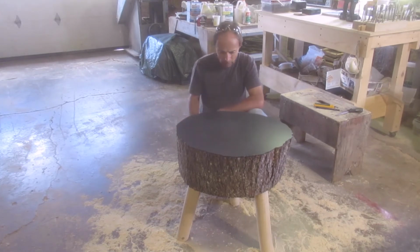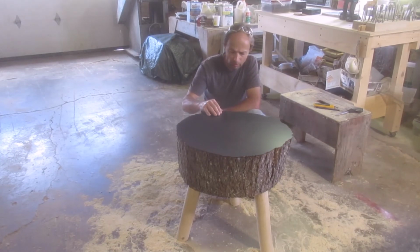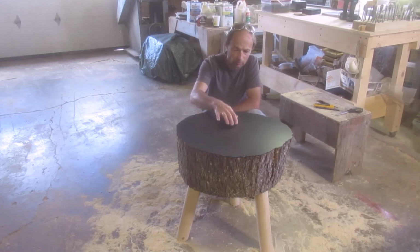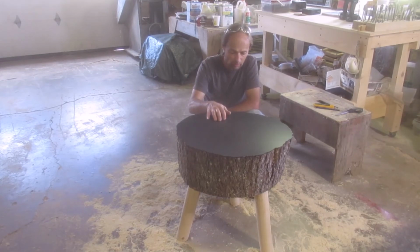It's not glued yet, right? But I'm going to glue this with epoxy, and then once that's done, I'm going to flip it on this surface, but I'm going to put newspaper on it. I don't want to scratch this surface, right? So I'm going to flip it upside down, and I'm going to put probably some Minwax polyurethane. Buy 2 cans of it and give it 2 or 3 coats, whatever the can wants to give me, right? And then that'll be the end of this project.